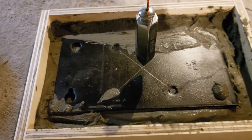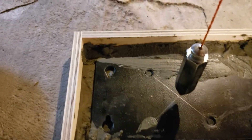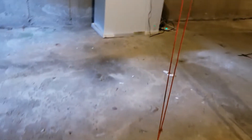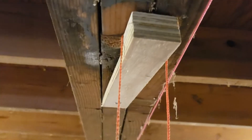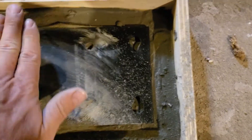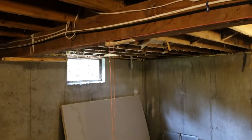There's my little concrete box. The pad's in place. As you can see with the plumb line, I'm pretty close to where I want to be in relationship to the center of the carrier beam. And this one over here is concreted in place. Now all I've got to do is cut those two down to size, drill them, put the capture plates on them, and then put them in place.